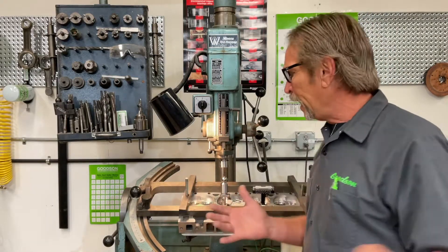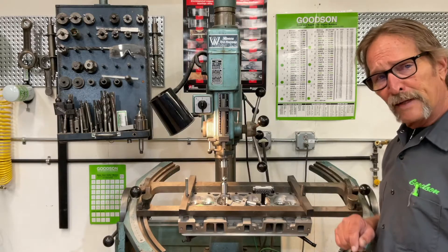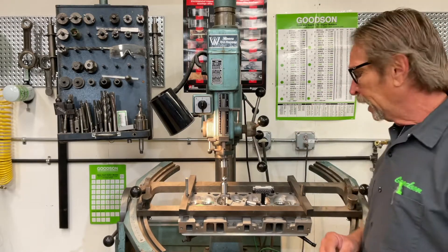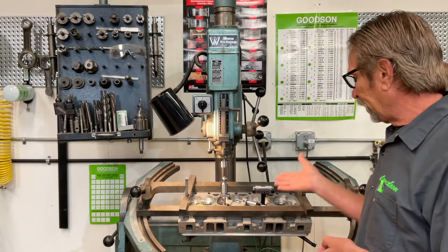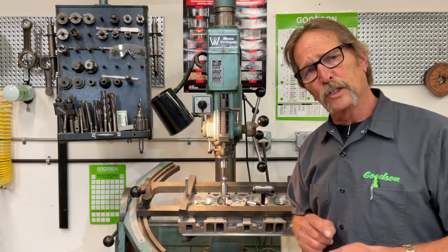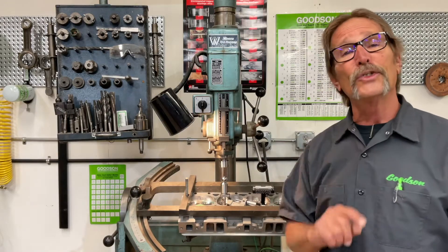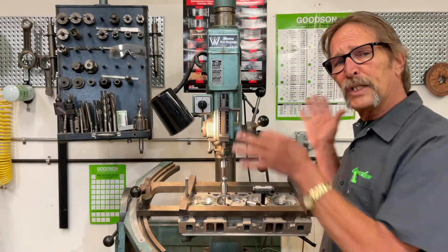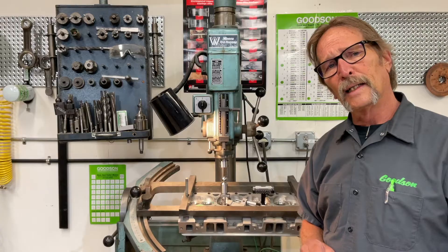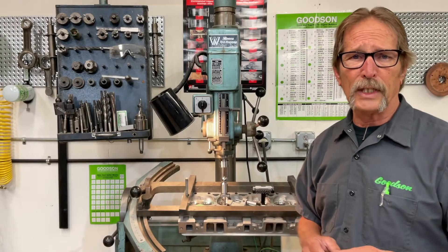Before I got started — good machinist that I am — I always double-check to make sure that my machine is level. I've got a level sitting inside that valve guide and I've already pre-leveled this machine left to right and front to back. That brings me to the fact that I also have to level my work piece to this machine, because the level itself has to be level, then you level the machine to that level, and then everything that goes into the machine uses the same level to sync everything up — top to bottom, left to right, front to back — in a single leveling effort. That's critical with seat and guide work.